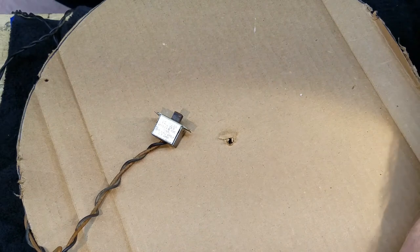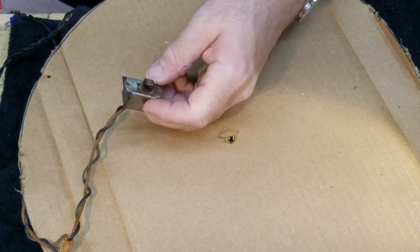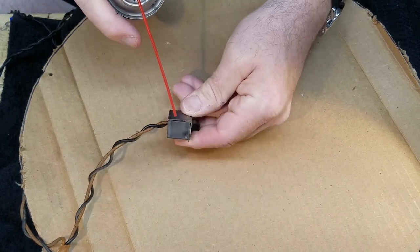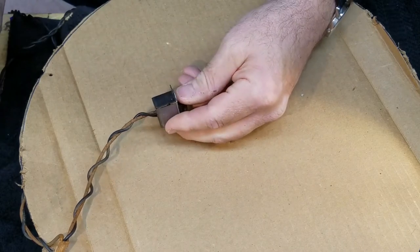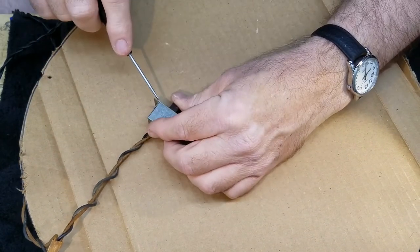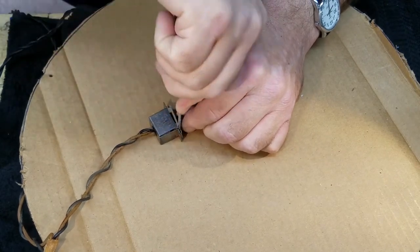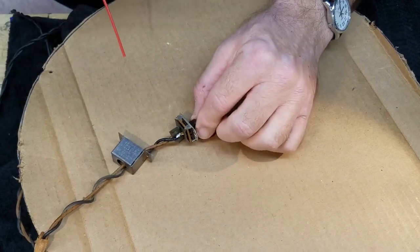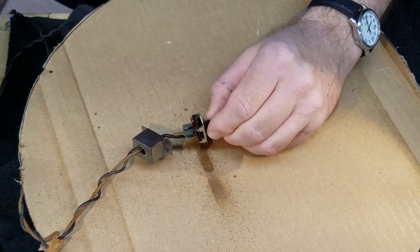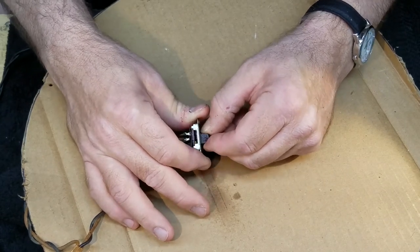I got to thinking - before I mount this motor, it might be better to go ahead and shoot a little deoxidant on the switch now rather than later. I'll clean this wire up too. I don't need to go crazy with this switch - I just basically need to get it wet down where the contacts are and then operate the switch a bit. Maybe I can get this to come apart. I don't need to go in any cracks at all - I can come right in here and get this switch directly. I don't need to do much, just want to clean it up so it'll continue to operate correctly. People tend to overuse deoxidant, and maybe I'm one of those people.